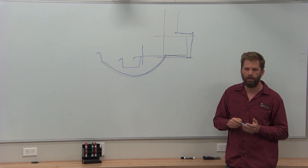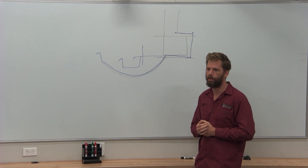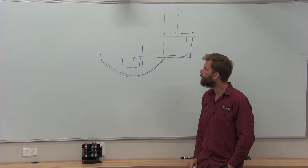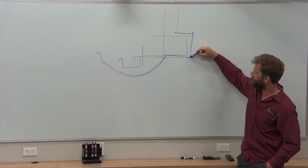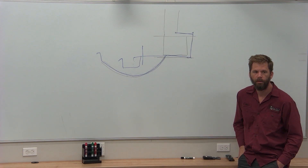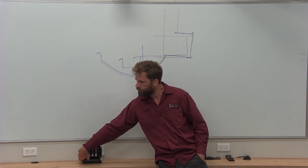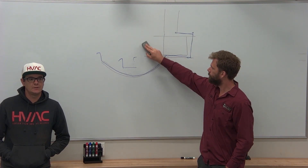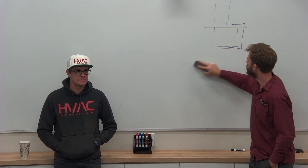Those are a couple of situations from last year — we were adding traps because they looked good in certain places, and there were several attic long runs that had issues, plus this very common one: if you can feel the play here at the drain corner, we should be pulling that drain up. It's too easy — even a maintenance guy coming back, if it hasn't been strapped and secured, servicing here and slowly pushing it down. Strapping underneath that corner is super helpful.